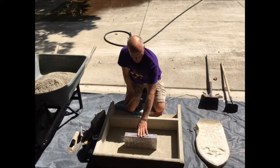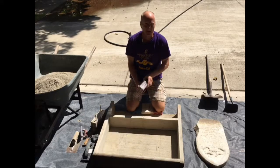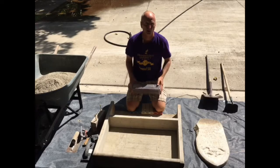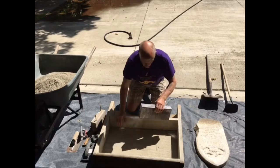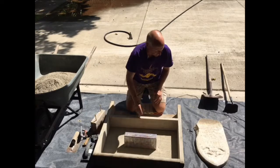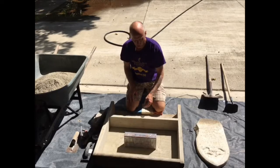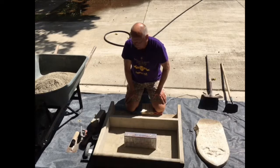The form I made to create the cavity — I've added one quarter inch on all dimensions. So we're half an inch wider and half an inch longer than the actual measurements of the tablet slot. I've got the base of the form marked so I know where this position goes, where the cavity form goes. Make sure that you've got a nice flat and square base so that it sits basically perpendicular to the floor of the form.